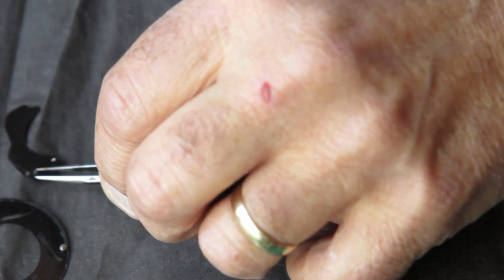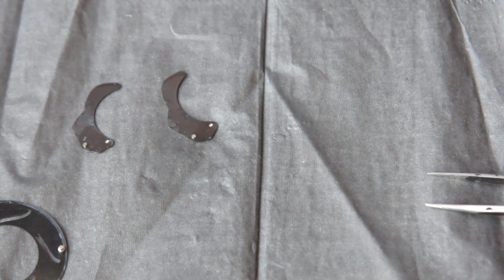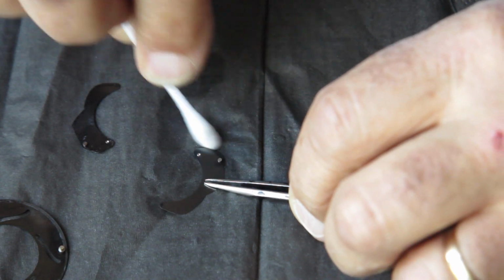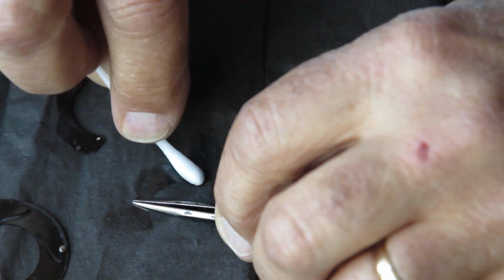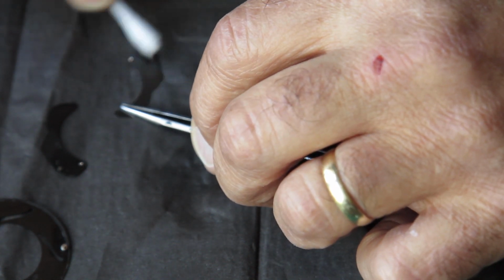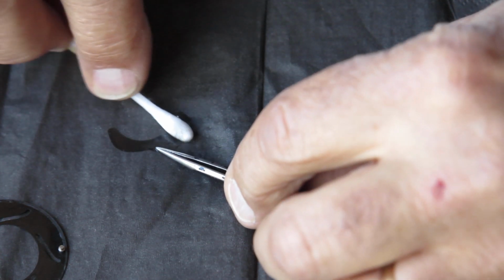The other problem that you often get when things are glued together is that the blades, the pivots, the little rivets that are on there on the blades, can actually tear out of the blade itself, rendering the blade effectively useless, because riveting them back pretty much requires that you would turn a suitable rivet on the lathe and then set it correctly. And unless you had a watchmaker's lathe and you had a good staking set, the chances of achieving that are probably not very high. It'd be much more sensible to find a parts camera to provide you with an undamaged blade.